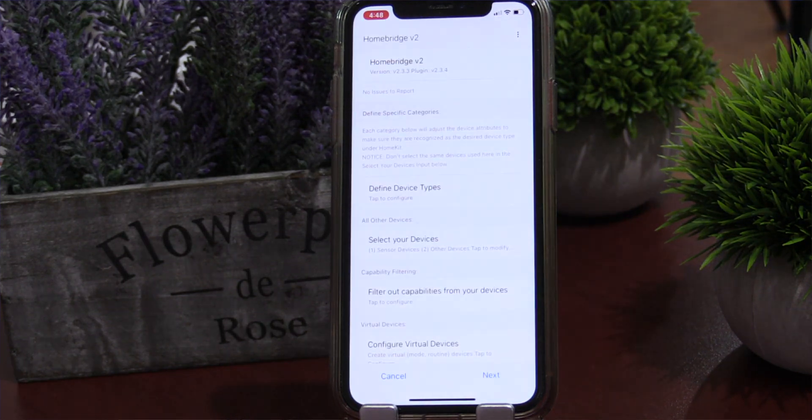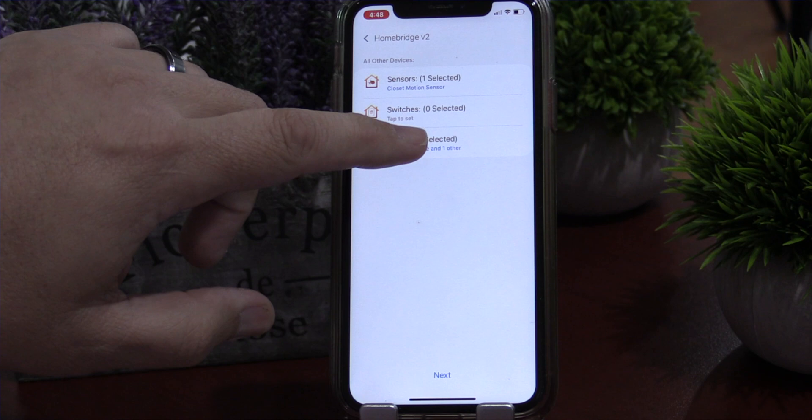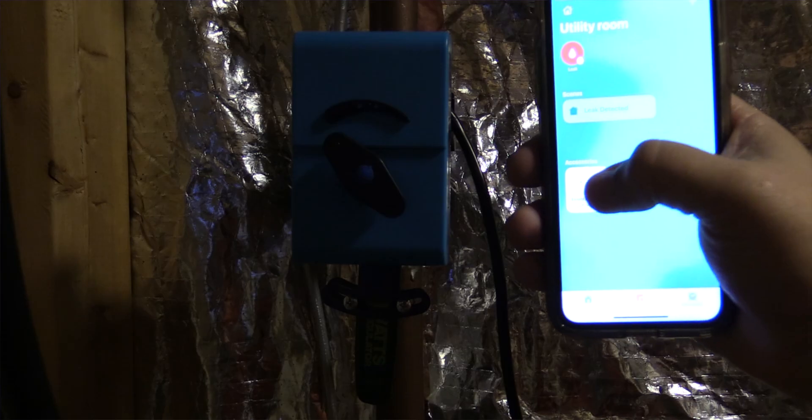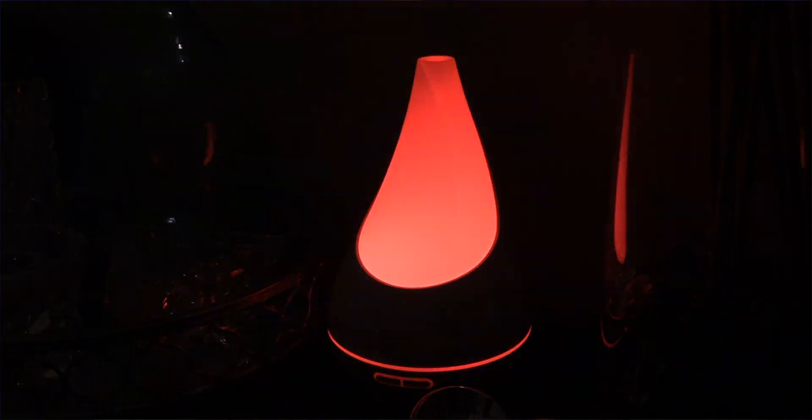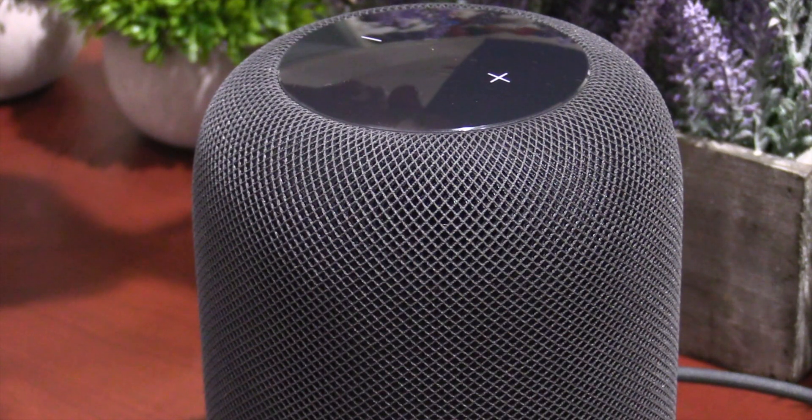Once SmartThings is set up with Hoobs, go back into SmartThings and set up your shutoff valve. Just add the accessory and it'll walk you through all the details — it took me maybe two minutes. Triple-tap the module on the shutoff valve and it'll automatically connect to SmartThings. Then go back into SmartThings, go into Smart Apps, go into HomeBridge, and expose this to your HomeBridge. Once you do that, it will automatically come over to HomeKit through Hoobs. The only thing left is to automate in HomeKit: if any of your HomeKit water sensors get triggered, shut off the water valve. You can also set up a shortcut to flash red lights around the house or set off a siren on your HomePod. You can use any HomeKit water sensor, or even SmartThings-compatible sensors, to trigger this shutoff valve.